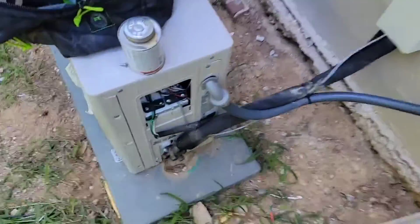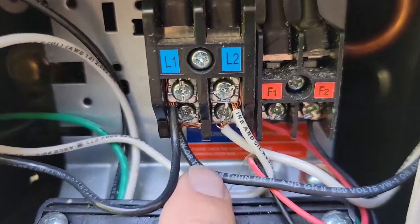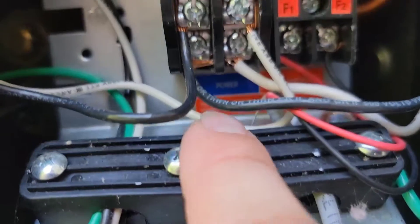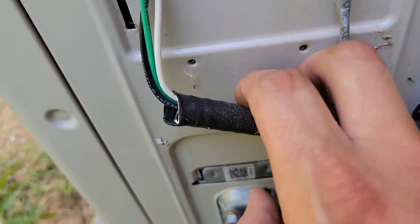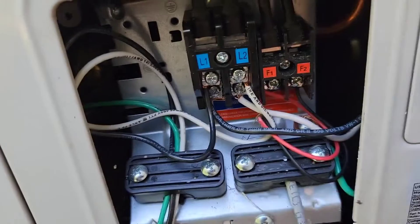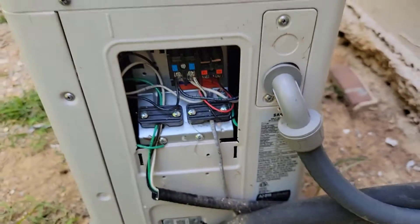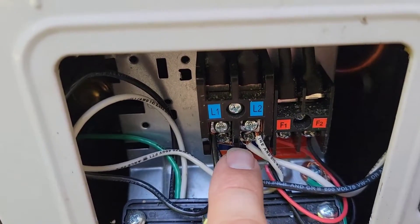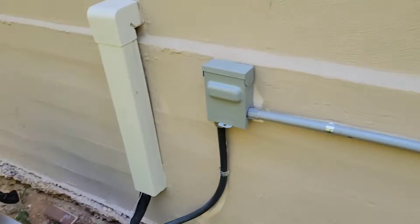Just in case you don't know — this is your line voltage coming into the unit on the bottom. It says power. And then these two wires go to the indoor unit. That right there is the conduit for the wire going inside the wall mount air handler. F1 and F2 is communication wire. So, power wire to the unit, power wire to the indoor unit from the outdoor unit, and then communication wire. Pretty simple.